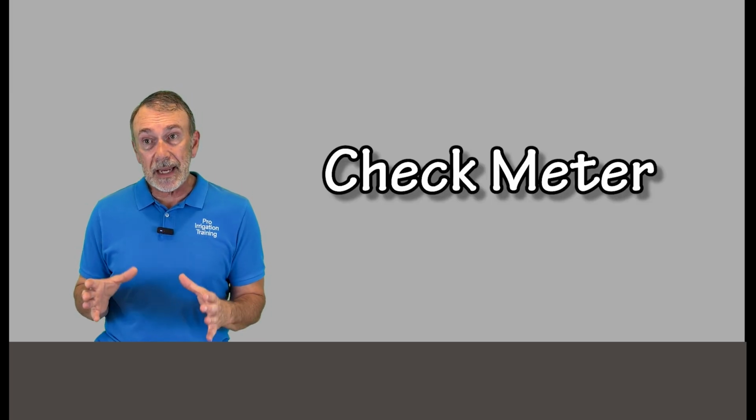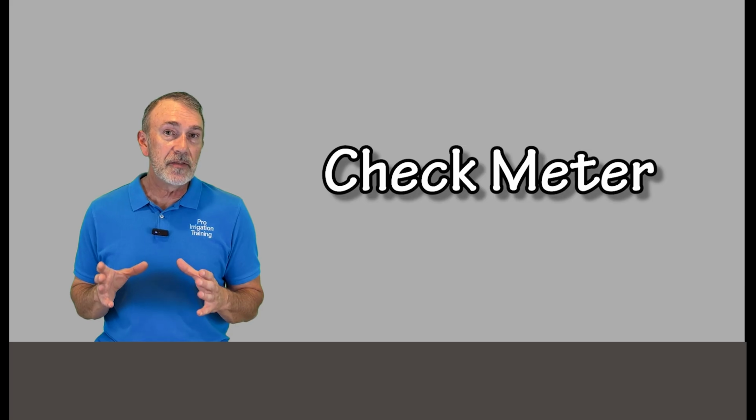And now also maybe what you want to do is go and look at the meter and determine if the meter is turning as fast on that zone as it is on other normally operating zones. And that can tell you right there if hardly any water is coming out of the heads, but the meter is spinning just as fast as it would on another zone, then you know you've got a pipe break or a leak somewhere that you're just not seeing. And I've seen leaks before that were somehow going down into rocks and never presenting on the surface. And those are wild issues, but very rare. So normally you're going to see it there. So check your meter, check the property, walk around.